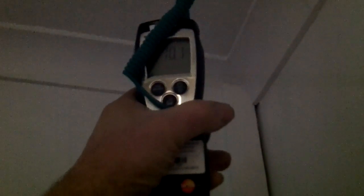...we put the probe on, we are looking at a temperature of ten degrees at the top, and down here at the bottom you can see quite clearly it's plummeting — on this cold corner it's going down to nine point four, nine point three. Much, much colder on this corner because there's a cold exposed corner. If we come through to the other side of the front of the house...